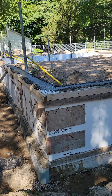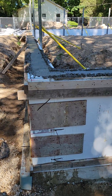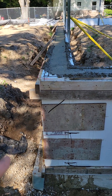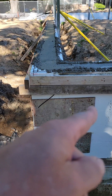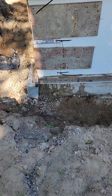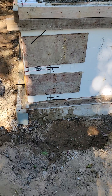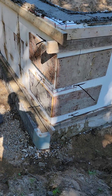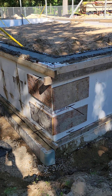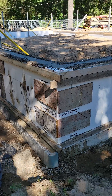The studs don't have much grip at all. So what we did here is ran some two-foot pieces of plywood from the corner piece right there, over two, and got two ties in with it. We also at the bottom ran a two-by-four back about eight feet each way and screwed them into each other. That's definitely abnormal — the way we did the plywood is abnormal. Those were extra things we needed to do because we did not trust this wall.